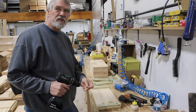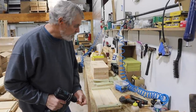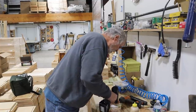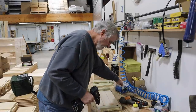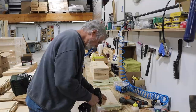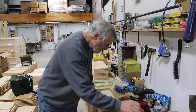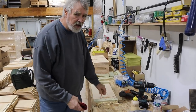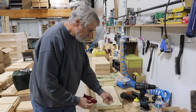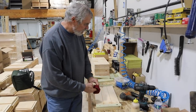They're 1¼-inch screws, so we sink them about 1/4 of an inch because we have about 1.5 inches of material here. And you can see when we're done, there's a lot of glue oozing out, and I feel like that's what you really want. A little messy, but you get a lot more longevity out of your bottom board that way.